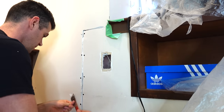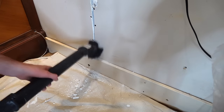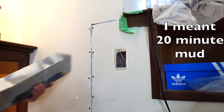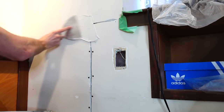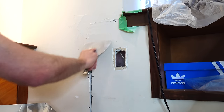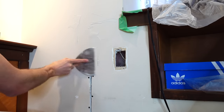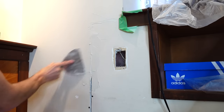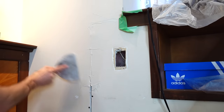Time to mix up some mud. The next thing you're gonna want to do is vacuum it out really well so that the new mud can get a nice bond to the edge of the drywall — that way it'll be a nice strong joint. I've just mixed up some five-minute quick-set. This is the Hamilton brand that I love, so I haven't added any glue to it. You'll notice I do that in some of my videos — adding glue is something I do because some locally available products in my area just don't have good adhesion and they've failed me a few times. Okay, so I'm pre-filling right now to really make sure that we get that joint nice and full.